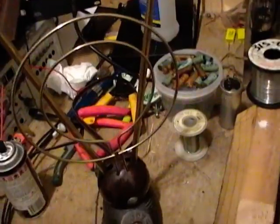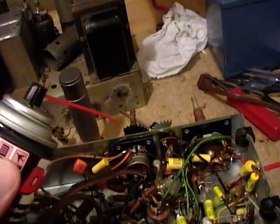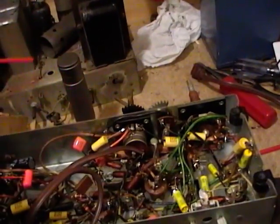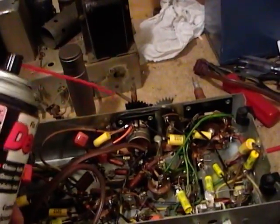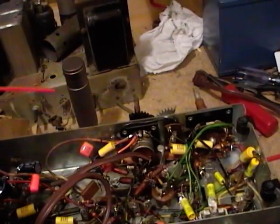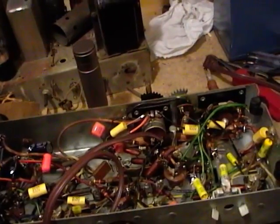I've got the FM antenna hooked in with a pair of rabbit ears, but before I power this back up, I'm going to shoot a little bit of DeOxit into the volume control. When you do this, make sure you've got the set turned off and unplugged because this could form a conductive circuit while it's still wet. I spray a little bit on, rotate the control, wait a while for it to dry out, another spritz to flush any debris out, rotate it a bit, and wait a bit longer to make sure all the solvents evaporate.